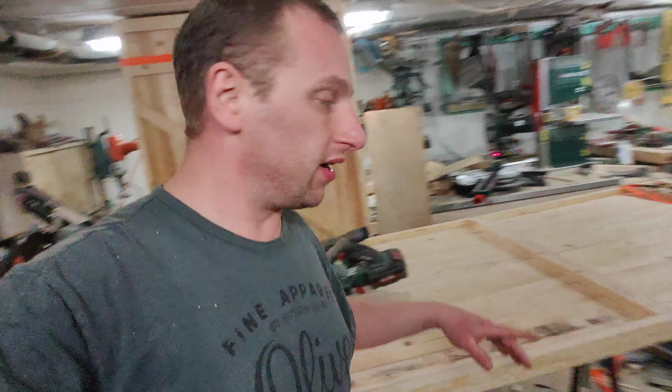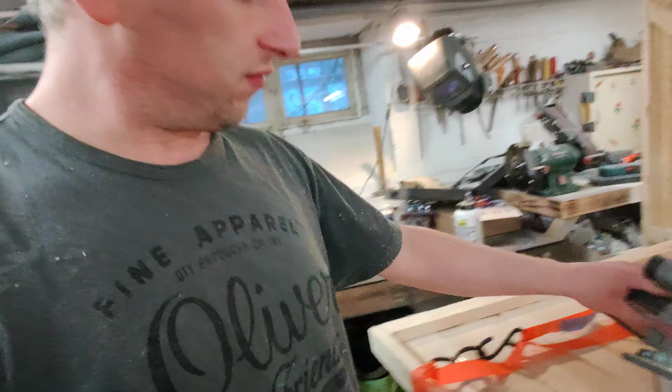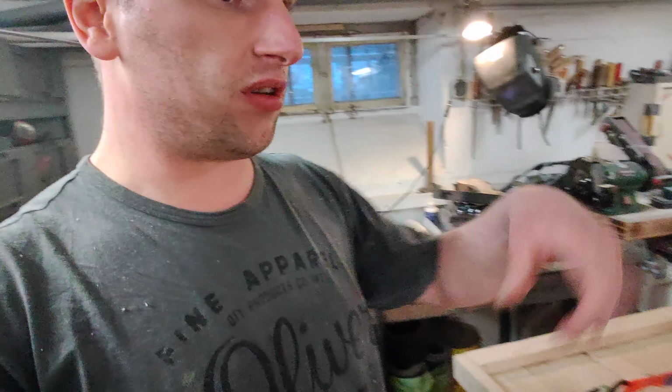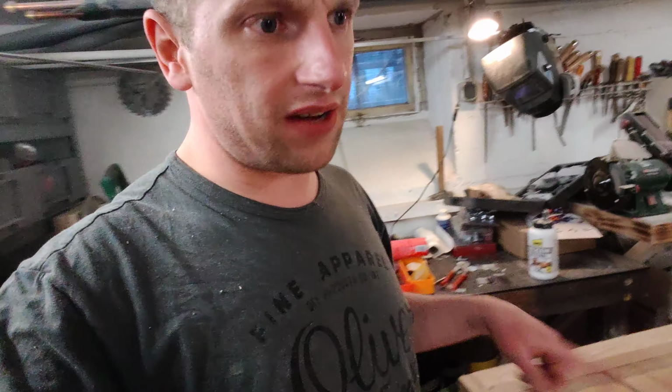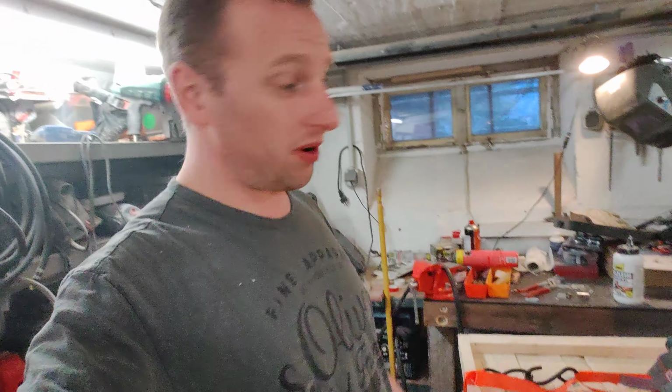Nice wee cut on there. As I said, the battery was pretty damn flat already. I did three cuts the same yesterday with the same battery, so you're going to get 6 cuts pretty much of that length. That there is 90 centimeters wide, so you're going to get almost 6 meters of cut, 5.5 meters of cut pretty much, from a fairly charged 4-amp battery, which might not seem a lot, but considering what it's for, I would say that was pretty damn good.